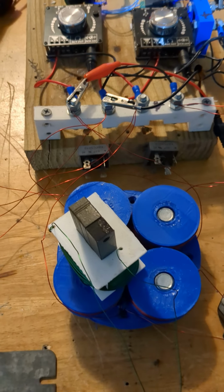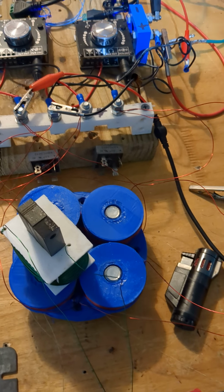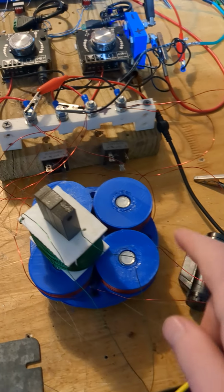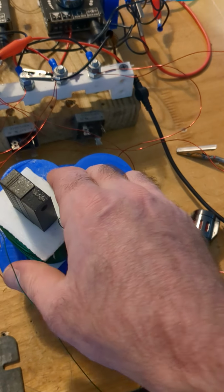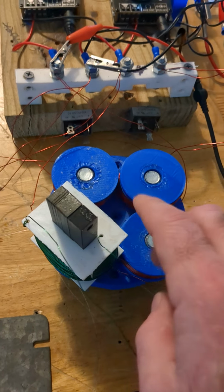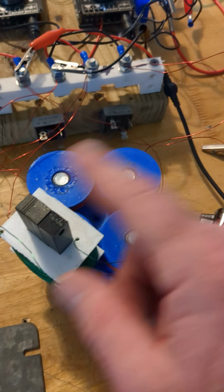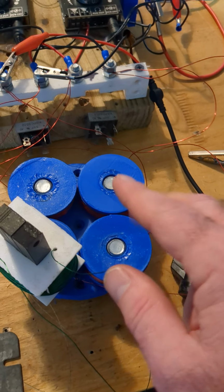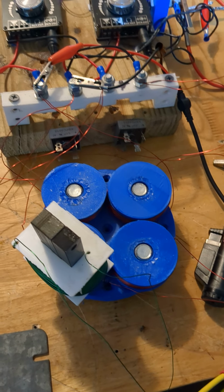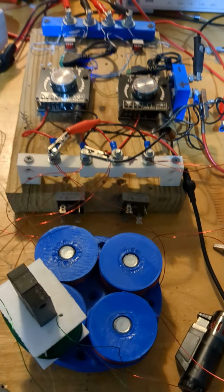Anyway, I think next, stay tuned. Next I'm going to take 4 transformers instead of coils and do this exact same hookup on transformers. So each transformer has a secondary enclosed in laminations, a full core, and see if that takes care of the back EMF problem and if it still rotates like I want it to. So that's what I got right now.